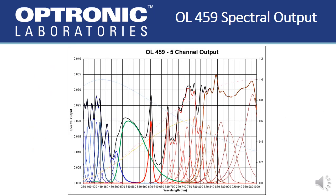The combination of up to 80 individual LEDs in the 5 channels — one blue channel, one green channel, two red channels, and a near-infrared channel — provides a programmable broadband spectrum throughout the visible and into the near-infrared. Within this broadband spectrum, individual spectral or color profiles can be programmed by manually adjusting the driving currents to each individual channel, with up to 10 separate profiles being stored in the unit's internal memory.